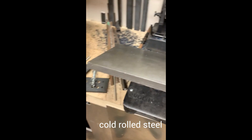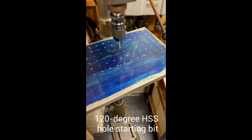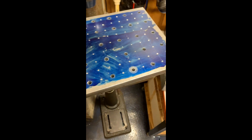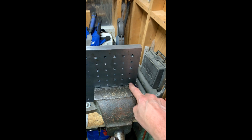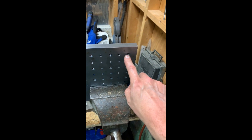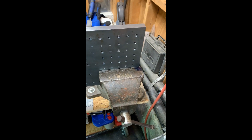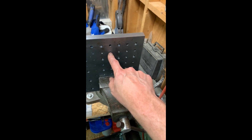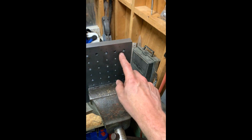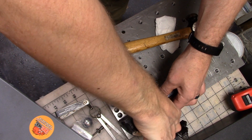So here it is — it's 28 inches long, three-quarters thick, 10 inches wide. This is where the fence is, this is where the saw cuts. I put dowel pins every other hole all the way down on 3/8-16 threaded, and between them where the fence goes there are three dowel pin locations — reamers are still coming. Down at the bottom where there's a clamp I put a bunch of dowel pins too, and then I did a bunch of 1/4-20 holes here. For small parts that don't need as much lockdown pressure I'm going to be working in this area. I'm just going to snug this down and see how we're doing for squareness.